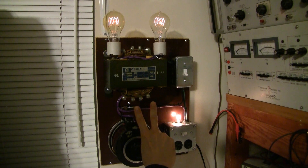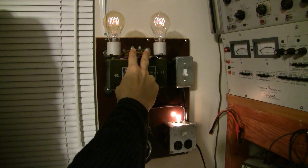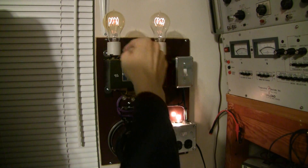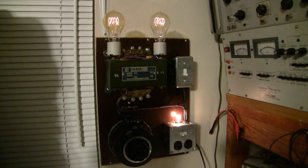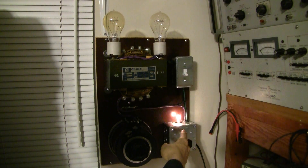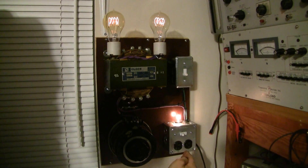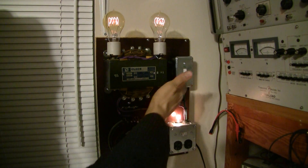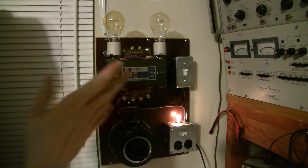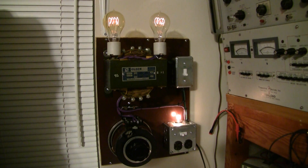The voltage comes out of the Variac and goes into the primary of the transformer at those two pins. The isolated 120-volt supply runs back out into this box and into this outlet — so this outlet is 0 to 120 volts. The two windings up here are the 240-volt windings, and those run down into this other box and outlet, which goes from 0 to 240 volts. Each outlet has its own dedicated connection — no accidental switching between voltages. The upper switch is the current limit: when turned, it bridges the light bulbs out for full 8-amp current into the transformer.